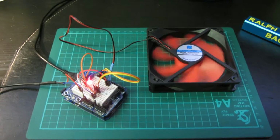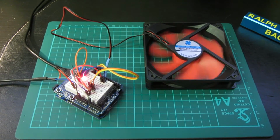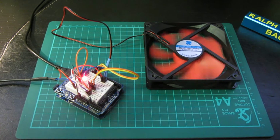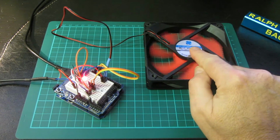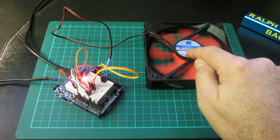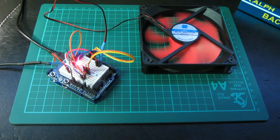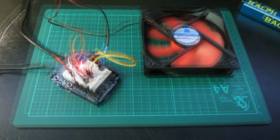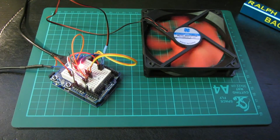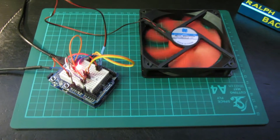And I remember something like this happening when I first made the circuit for the microchip version in my cupboard. And I wondered what it was all about. And the reason is because the pulsing of this motor, the mark-space square wave, is being output by default from the Arduino library within the audible range. The default for pulse width modulation is 490 Hertz, which is like a low droning whistly sound, which I'm hoping, as I say, you picked up from there.